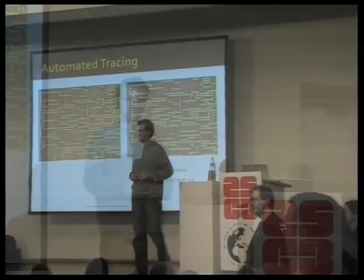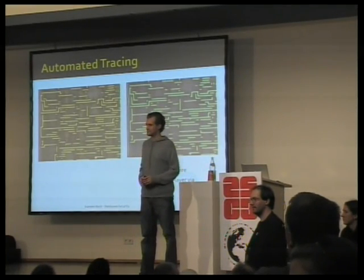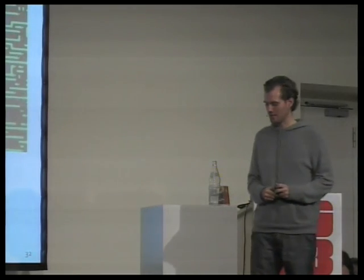Is it really as simple as you say to reconstruct the wires? Because as far as I know, there are at least 5 to 7 metal layers to interconnect the transistors there. That can be. I think the record is around 13, so anywhere between 1 and 13 metal layers. But once you have the process automated, it's easy to work with more than just a few layers. Fortunately, the chips we have been looking at are older because they implement proprietary encryption, which has been known to not be a good idea for a while. They have had at most 4 metal layers.